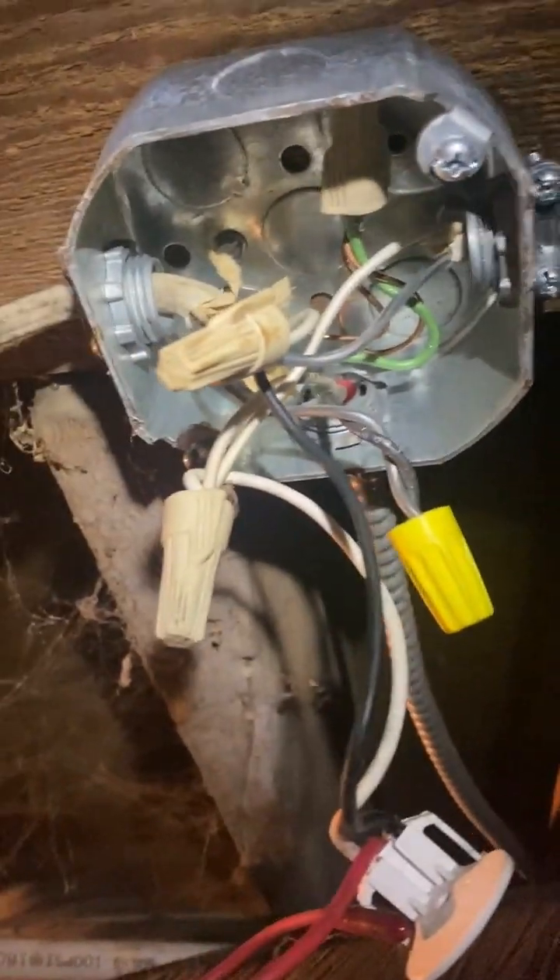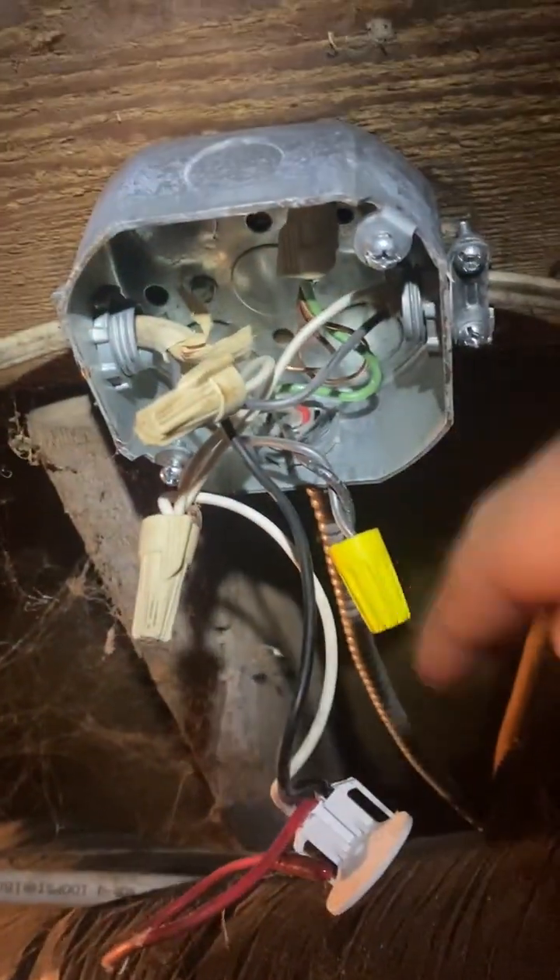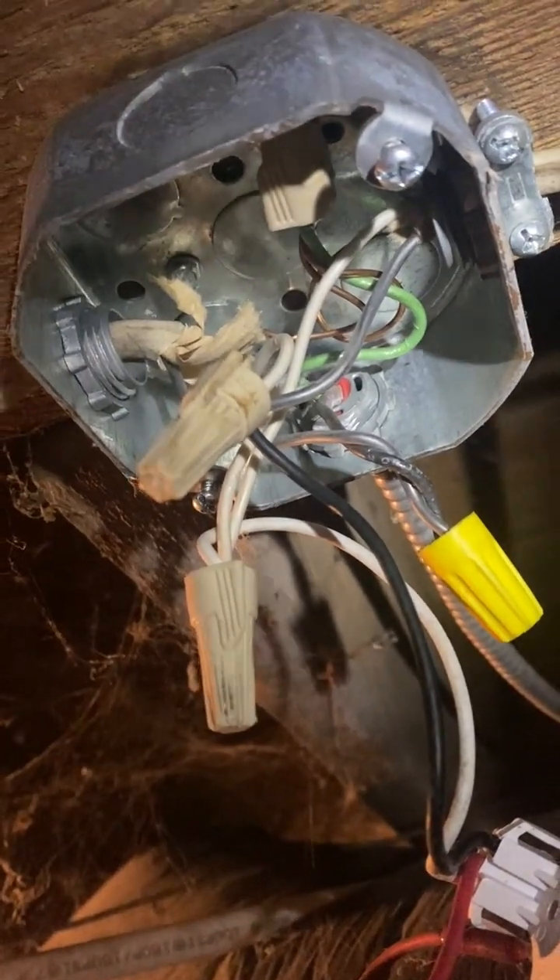This means whatever is going in that direction appears to be functioning in series rather than in parallel, which seems very odd to me. Because if whatever is connected to this mystery wire is open circuit, then the furnace isn't going to work. And because there's reverse polarity happening, I think it also opens up the possibility of current going on the neutral, which is what I was observing.